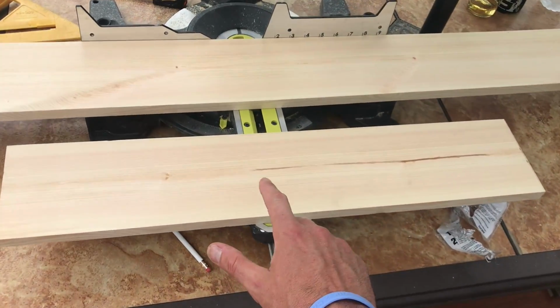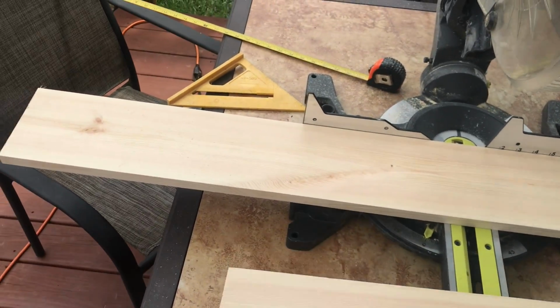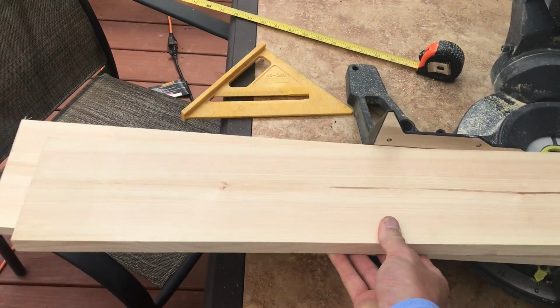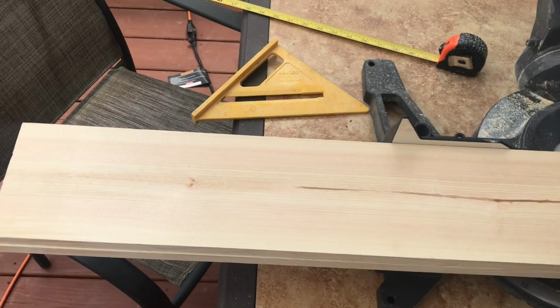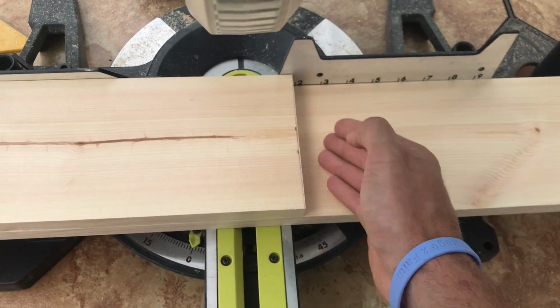So counting this piece we just cut, we're going to need 2 more. The best part, instead of measuring 28 inches with the ruler and doing the quick square, is just to lay your first piece out on the existing board, mark it out, and then we'll go ahead and cut out 2 more.